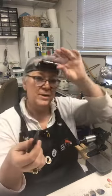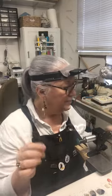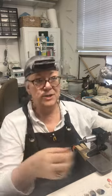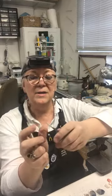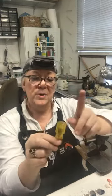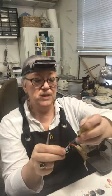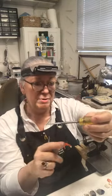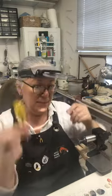If you have an old broken drift or punch like this, it makes it really easy to adapt these for a new tool. Scribes are a little bit different. Scribes and scratch-alls — A-W-L — are these kinds of tools. This is an awl, which is usually used for jabbing things and marking your way around. They usually have a really good center punch tip on them as well. But because they have a plastic handle, you don't want to hit this with a hammer because it can shatter the handle. If you have something like this and you want to use it as a center punch, see if you can cut off the back end and sand it down so you don't have any sharp edges. But it works great as a scribe.